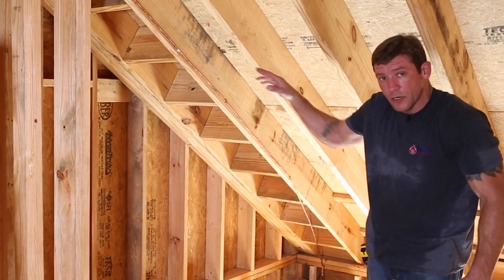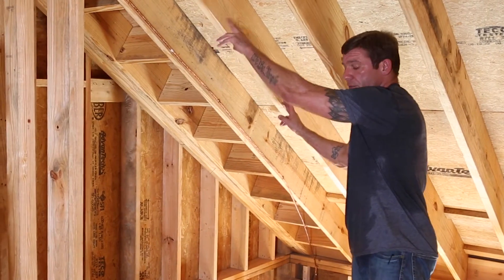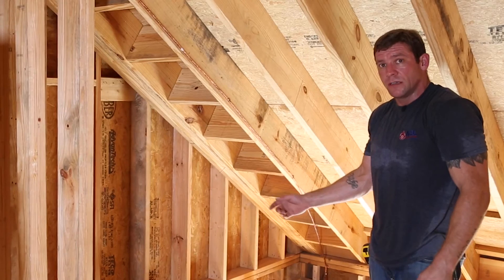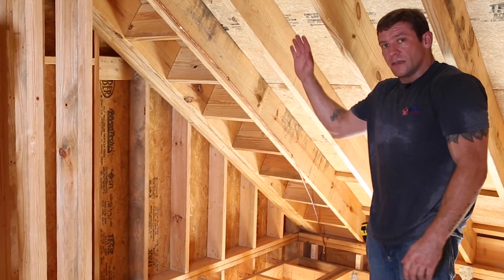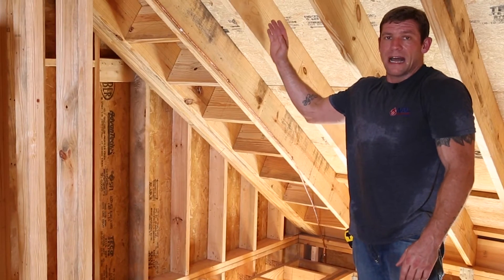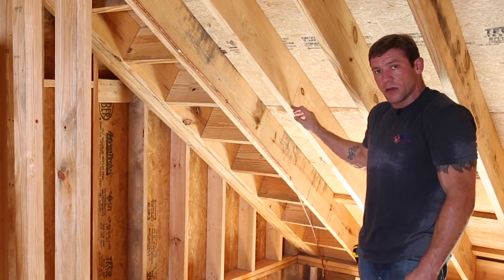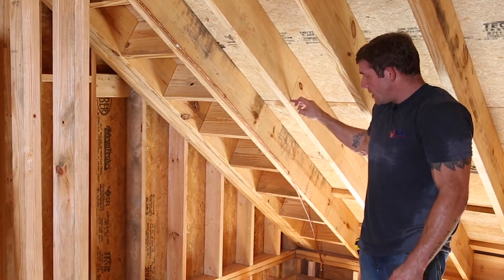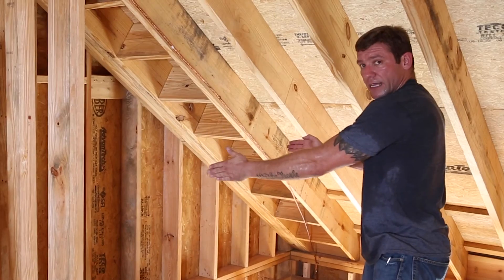It's important to know exactly where the points are on a sloped ceiling and how to figure out the distance for your platform and how to triangulate that so you have even points. The first thing you want to do is find the center of your unit. So let's say my center is right around here — I've got a 24 inch platform, I've found the center, and I've already got my first mark in here. But how do I get this to triangulate over here at exactly 24 inches once the rods are already hanging?